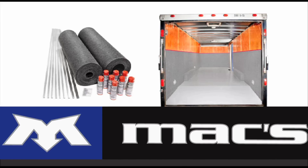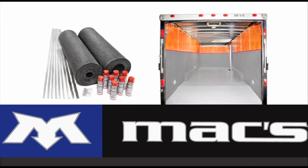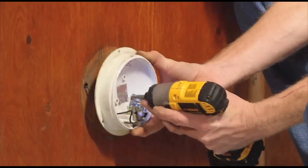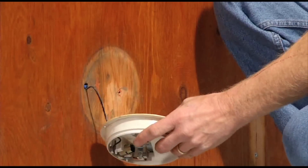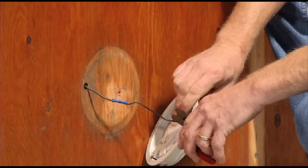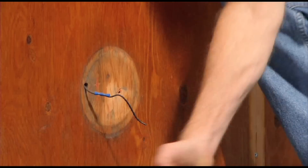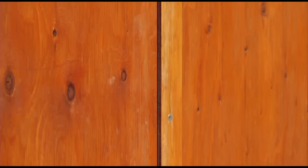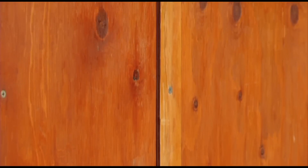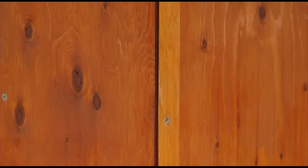It's everything you need for a custom installation. To begin installation, disconnect power to the trailer and remove any electrical switches, outlets, etc. located in the area to be covered. Our 24-foot classic brand trailer has four round lights that need to be disconnected. In addition, there are vertical wooden trim pieces that need to be cut so the wall material can be installed on a flat surface.